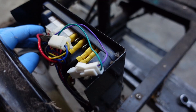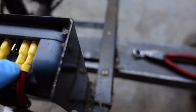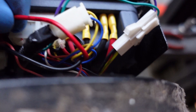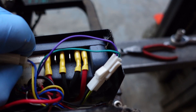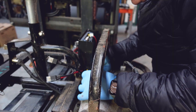Let me take you inside the control box. This is a standard Curtis controller used in these buggies. You have a 24-volt input, 24-volt motor output, and a Molex plug that connects all of the harness loom in one plug. This end plug here is for the Curtis control programmer — you plug into that four-pin connector. You also have a charger connection, a beeper, and a key switch. They're all simple plugs that can come away to release the controller and the loom.